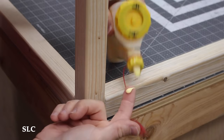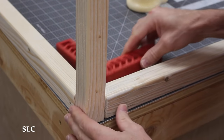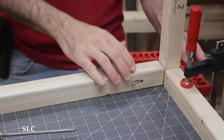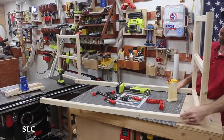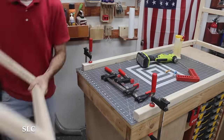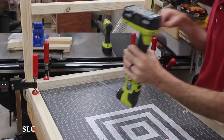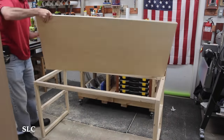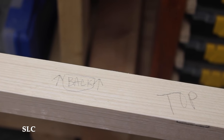I next positioned the legs in place, and this time I did remember to add the glue before the screws. Using a corner square made it a lot easier to check my angles, and the use of squares to hold the wood secure made it a lot easier to screw together. After attaching the other set of legs, I flipped the desk onto the floor and gave it a test fit with the desktop. Everything seemed to line up, so I kept going. It's also a good tip to mark the front and back of your frame just in case it gets turned around.